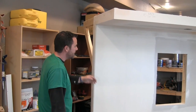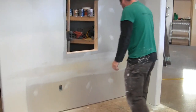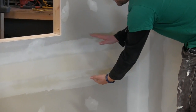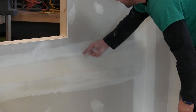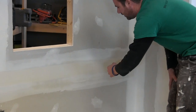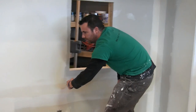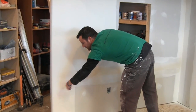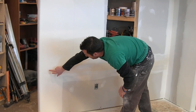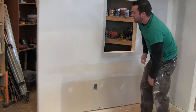I jumped down and took care of this flat area — it ended up going the full width of my trowel, but I made sure it's feathered right out and you can see it's already dry. I basically went tight to the drywall, filled up the beveled edge, took that all the way across and right off the end. You can see how it's filled up even all the way over to here — there must have been just a little bit of a hollow.